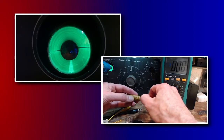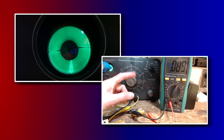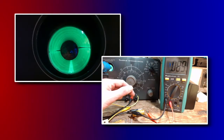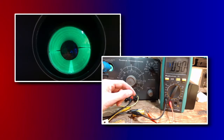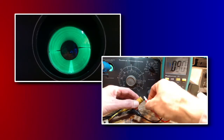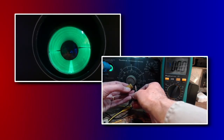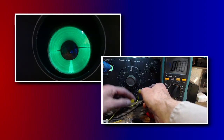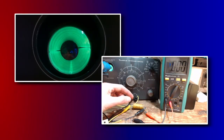Digital one here. Of course, these two instruments use totally different techniques to derive the capacitance, which is what makes them so interesting to use. So we're getting a 0.01 here. No, 0.09. Okay, radically different reading from the two meters. And if you only have one meter, there'd be nothing to make you suspicious. What's going on here? I think we're going to find this is a very leaky capacitor.